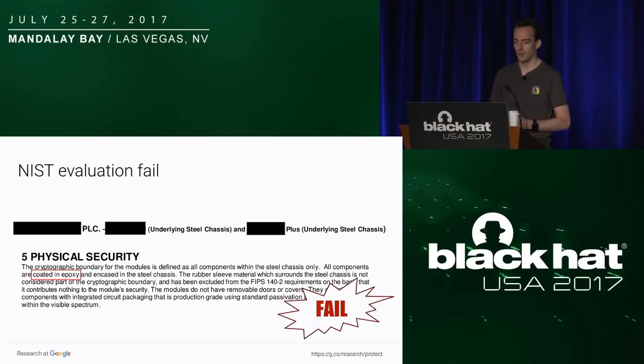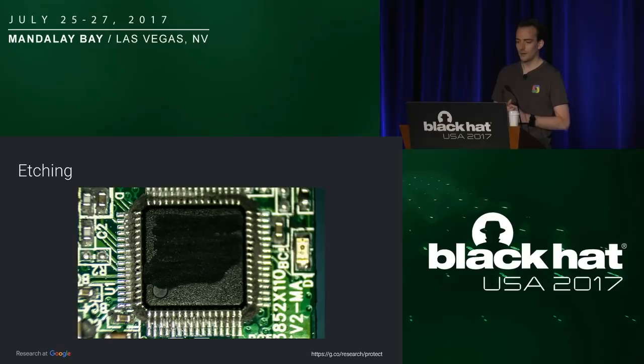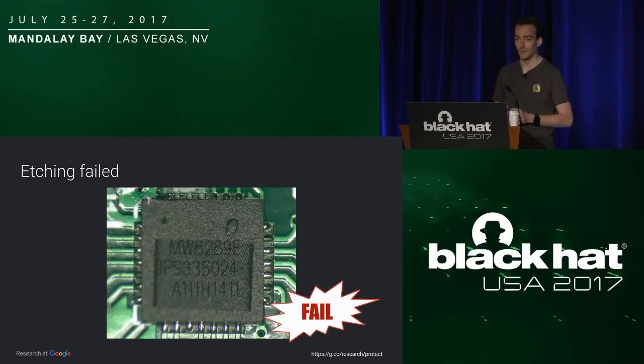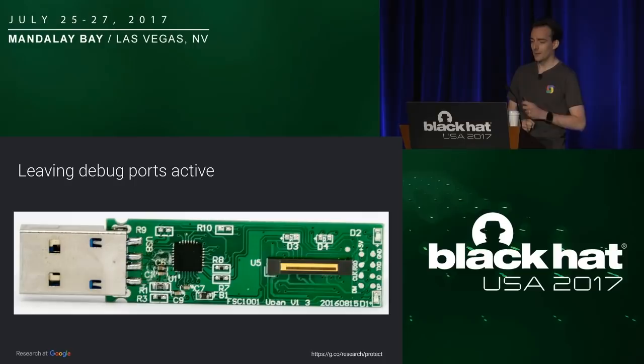Another layer of protection is laser etching the references of components. Even if it means security through obscurity, it's really hard to find data sheets for the USB controllers used, so if you don't have the reference, it will be very hard to identify which component they're using. It's not just a black marker — it's really milled so the reference is gone. But that's an extra cost in the manufacturing pipeline, and you have to make sure you use the right service, because in one case they paid extra for nothing — we could still see the component references. Another thing to watch at manufacturing is debug ports used to test the USB key during development: you can see small solder pads labeled as a debug port, and you'll see later an attack leveraging those.